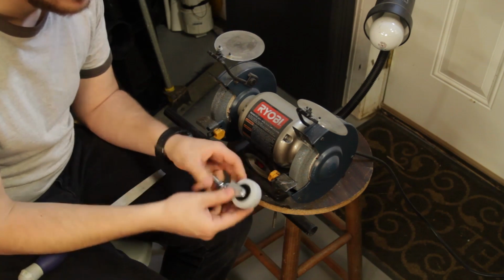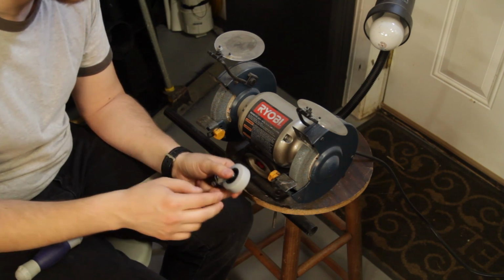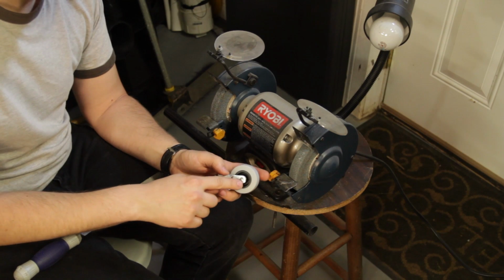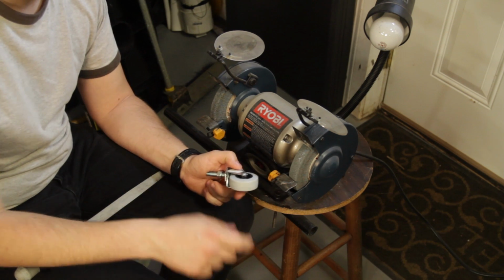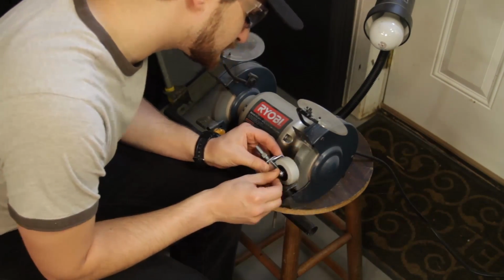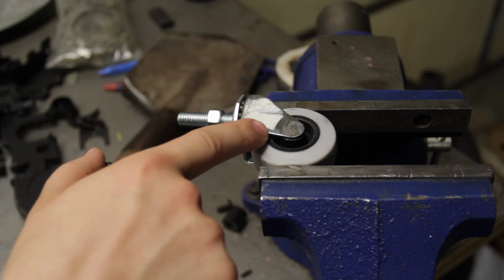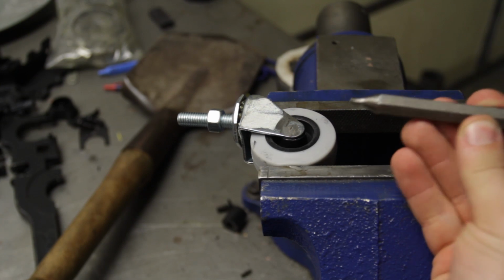Basically, if you look, we're going to pick the smallest side, because this is like a big rivet. It's been smashed from both sides. We're just going to take off this one side. Once we take off this side, we can just completely push it out through one side. Alright. So I have ground it flush, and it still doesn't want to come out, so I'm going to give it a little love tap with this punch.